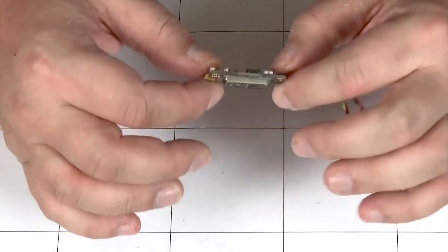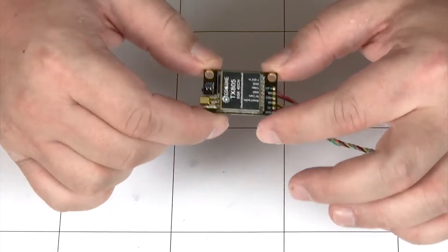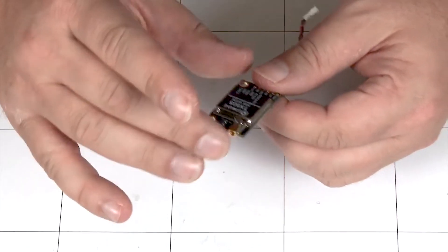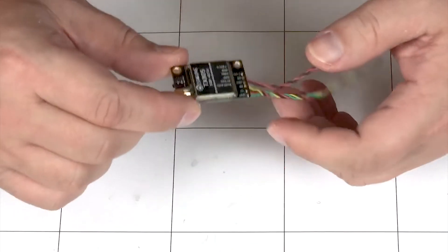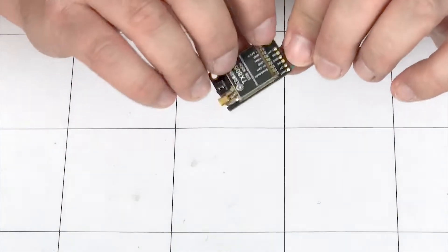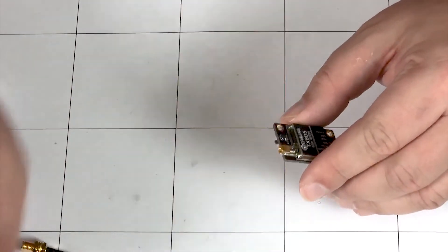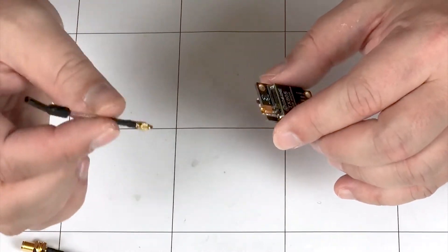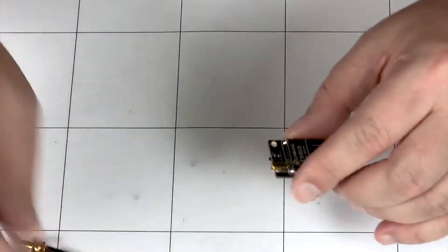What's great about this one is that it has the holes — that's what I love most about it. If you're not trying to do a really tight build, this is going to be going in my TBB quad and I'm not trying to make it difficult. I want it to be very easy to build and have everything in a home. So the fact that the video transmitter can just live in the stack, bolted on just like everything else — you wire it up, done. You've even got your antenna built in, so you don't have to worry about getting yourself an antenna. You just plug it in and off you go.